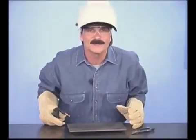The real challenge of welding overhead is finding a comfortable position so you have complete control of the wire feed gun. If the wire extension, gun angle, or travel speed varies, the amount of heat at the weld will not be constant, making the puddle more difficult to control. Find some way to be as steady as possible.